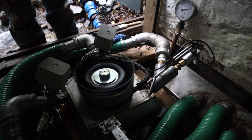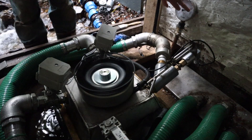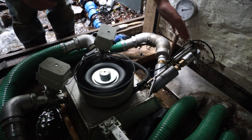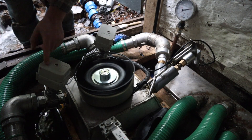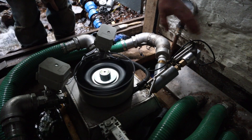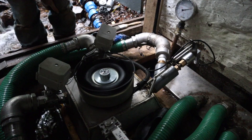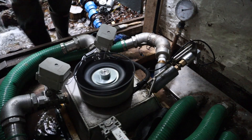Okay, we're set up so you should be able to see everything. We have a pressure gauge here — it's all on at full at the minute. There's an adjustable spear valve, this is the two-litre-per-second nozzle, this is the one-litre-per-second nozzle, and this one here is the manual nozzle which will stay on. I'll go back to the shed, turn them all off, then turn them on individually and show you what power they make as we work up through the power.